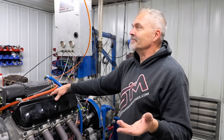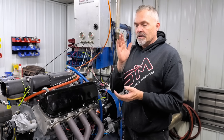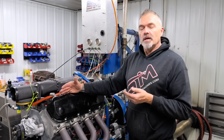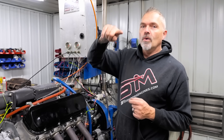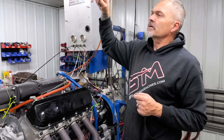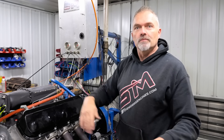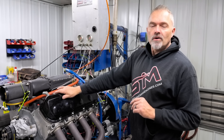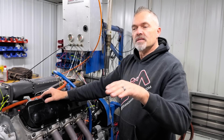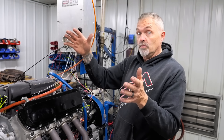Let's go out and make a pull on this. The engine RPM cannot exceed 4700 RPM, because that makes the tip of the prop go sonic — the tip of the blade would go supersonic. So the engine has a sweet spot where it runs basically from 3000 to 4700 RPM and pretty much stays in that range the whole time.